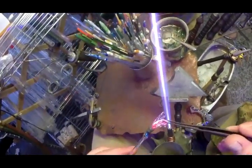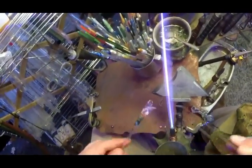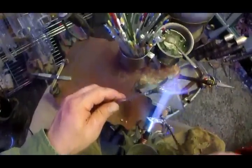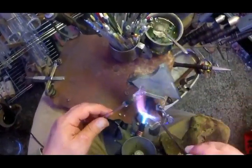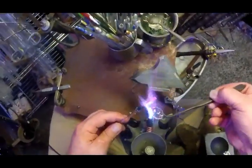Don't lightly tack them on with acute angles and very hot glass to cold glass. These will fracture. So make clean little welds. The next one I'm just folding around the first one so that they're kind of face to face, but the second one overlaps as it's getting larger. And we'll just keep welding those on and working our way out.